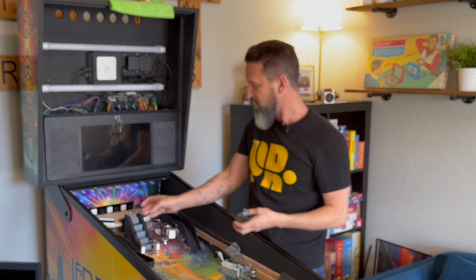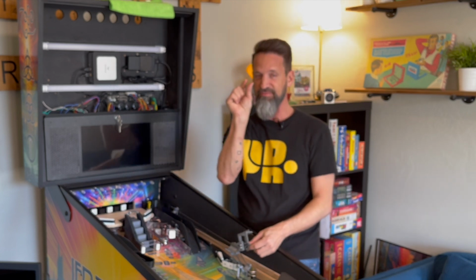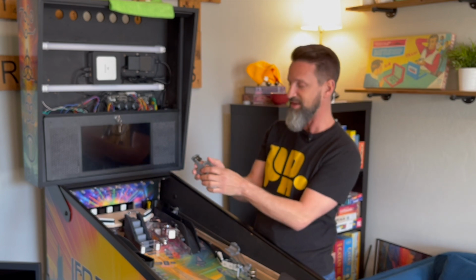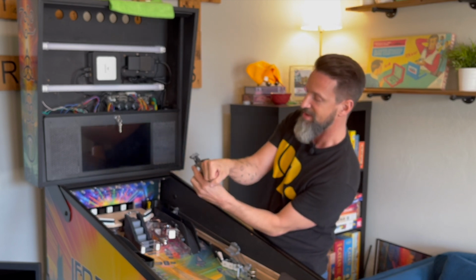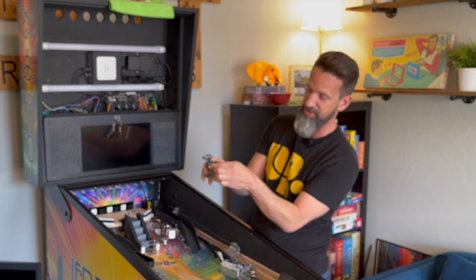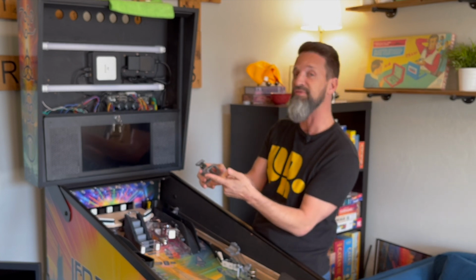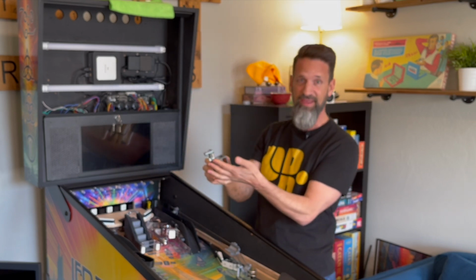The difficult thing is, when you're dealing with this staircase, it has a sharp edge. I really only have a very, very small physical space to have this work without it damaging the switch. Because if I get it to where just the very tip of that staircase, right? My knuckle is the tip of the staircase, just the tip of that is hitting it. If too much of the stair early on hits it, then it pushes so hard, it's pushing up in and it'll break this. It'll end up bending this like crazy. And eventually it would bend this so much to where it just wouldn't really register or would register very late, where then the stairs would always stop in a higher position, kind of past their true home, because it was bending this thing out of place.